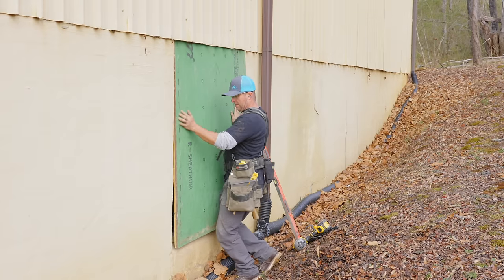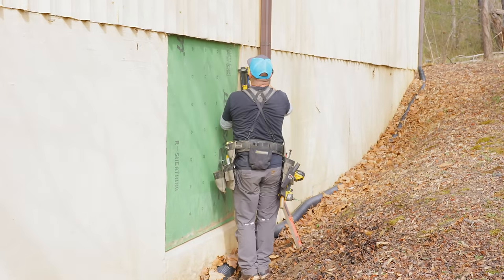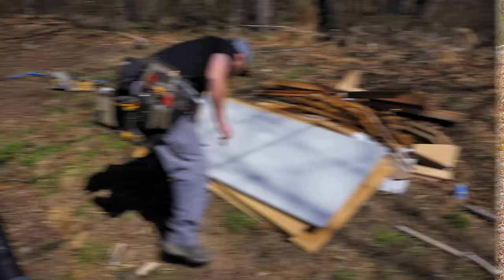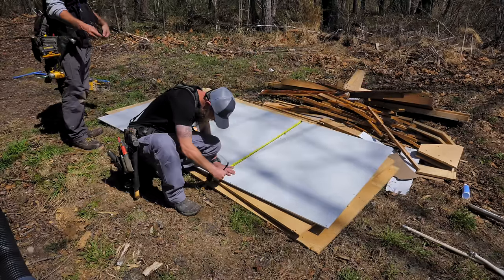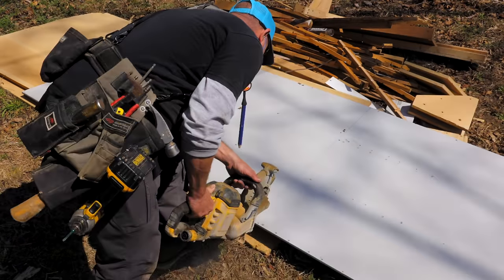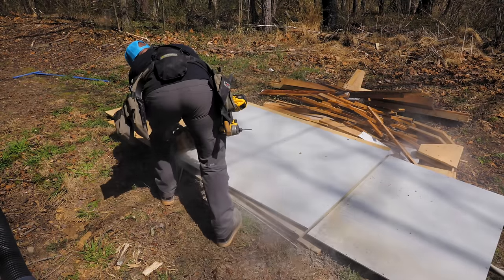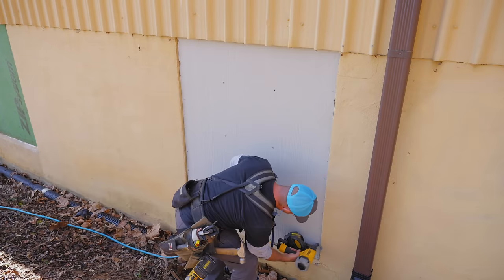On the outside of the shop, Jason and Jano worked on getting the windows sheathed with leftover Zip-R material. Since the window openings were exactly four feet by five feet, they were super simple to sheath with a single piece. The last thing was getting some siding on the sheathing — we used fiber cement panels from the metal working area of the old shop, as they match the block exterior fairly well. Cutting these panels is a super dusty job, and the concrete saw made really quick work of it. We used a siding nailer to attach the panels.